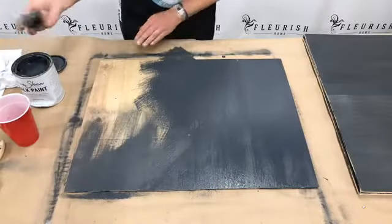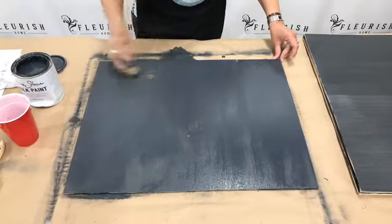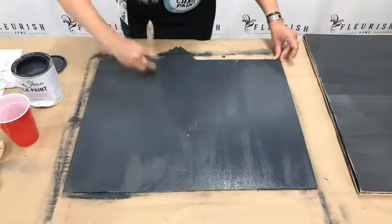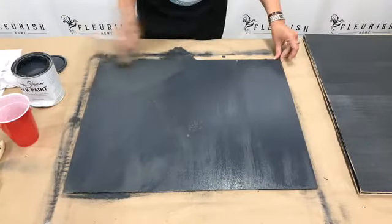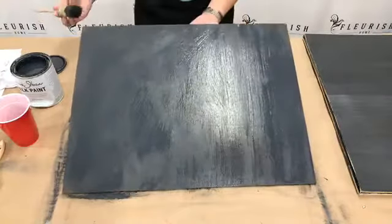Then we have the oval natural bristle brush, which has a lot more bristles. The way that they're tapered really helps push the paint along the surface. I'm going to paint in multiple directions, and I'm really just trying to get the paint across the surface in a nice, thin coat. Not only is it going to dry faster, but I'm going to use less paint. I can really go back into heavier areas and drag it along.